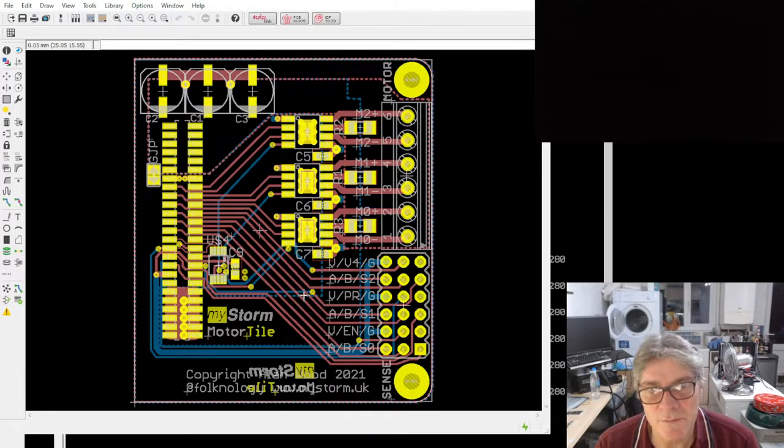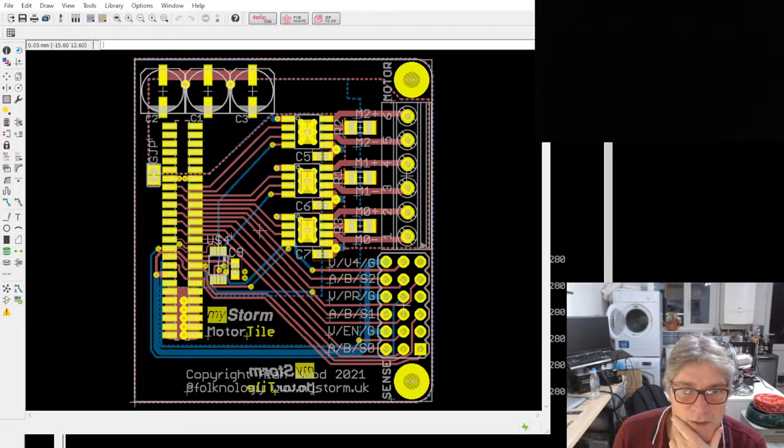But before we move on, let me know what you think is important for the mezzanine board. I guess one of the nice things is being able to drive that LCD type, you know, SPI plus reset. So I should probably include that connector on it, even for the most basic mezzanine board, because that's a nice feature. I do have a design for this, by the way. It's just not routed yet because I'm not sure what I'm going to put on it, and I've got lots of other bits on there.